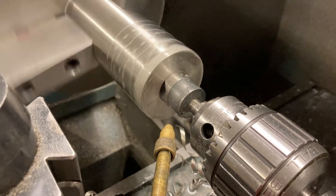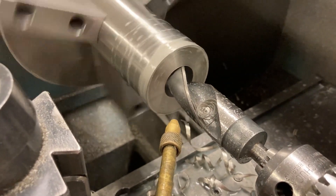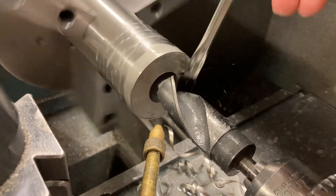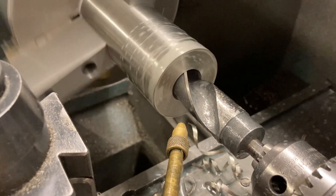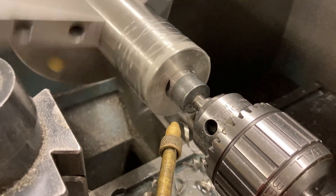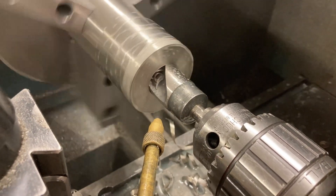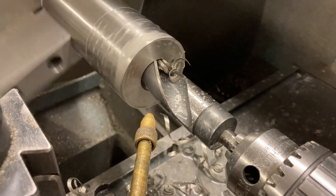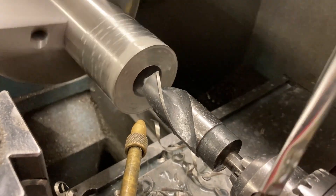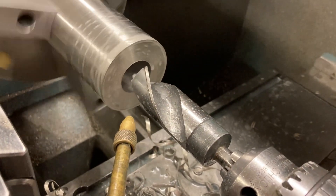Now we can't go so far — we've got to clear the chips earlier because we've run out of flute on the drill and they're staying packed up in the hole. Right here we ran out of flute and we're deep in the hole now, so the chips can't come out. We can probably only go maybe one turn at best before the drill gets packed with chips. Now, there is a through hole already, so they're not completely trapped — they can go out the back end. But they want to come out this way because the flute makes them ride up and come out the front, and when the flute is buried in the hole there's no place for them to exit.